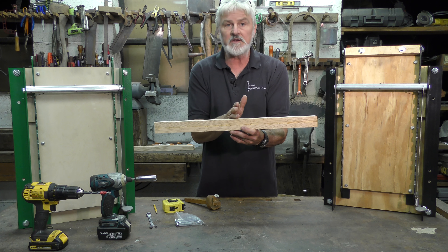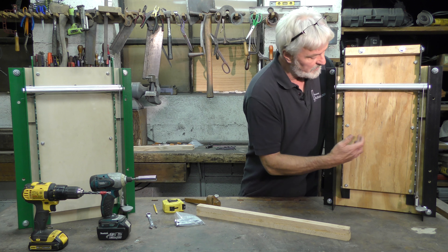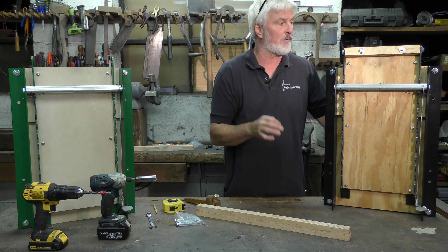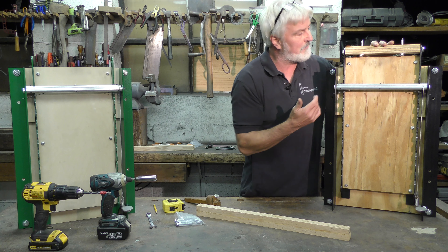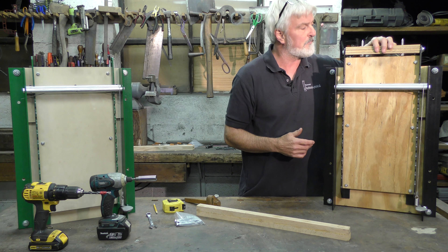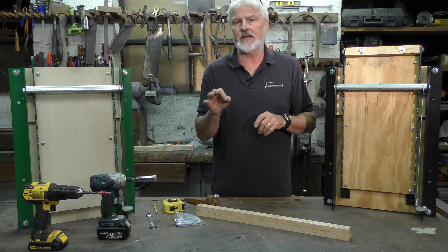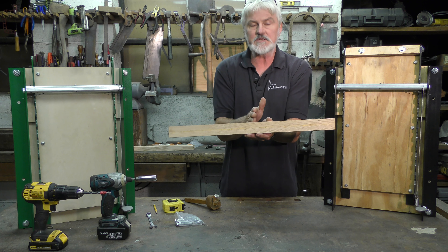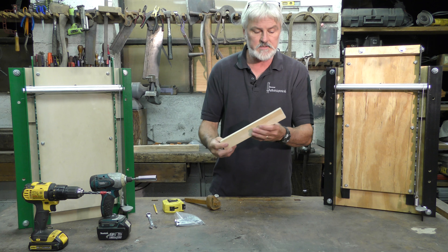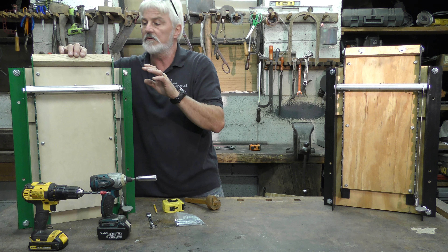The next thing we need to do is cut it into our two mounting blocks at the appropriate length. Remember this board is 11 inches wide, and to its edges we've bolted the toothed members — our mounting block has to sit between those two members. Not only does it have to fit in there, but it needs to pivot, and at one end it needs to pivot and slide. So we need a little bit of room, meaning the proper length is going to be a sixteenth of an inch under 11 inches. We'll cut this into two pieces and end up with two pieces that fit with that little bit of room we need.